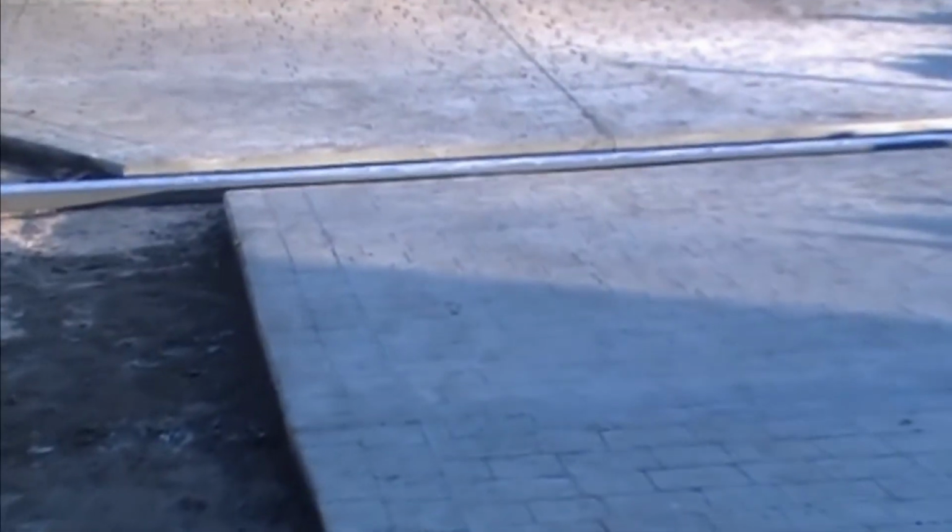Okay, the driveway contractor has framed for the 2-car driveway and broke out his excess concrete, and that's ready to pour. So we've went ahead and installed our channel drain across the center of the drive, leaving about a foot on both sides for aesthetics. And you can see that we've covered the channel drain with some blue tape so that when they pour their concrete, it does not mess up our grade at all.